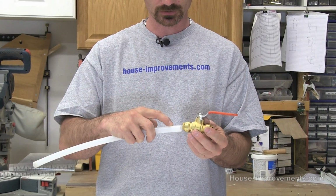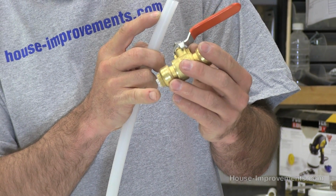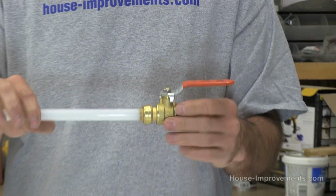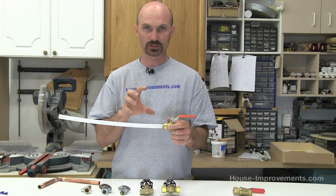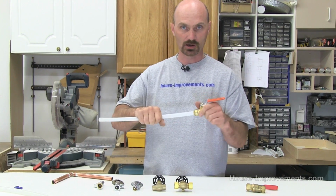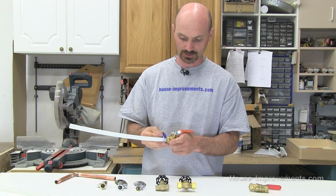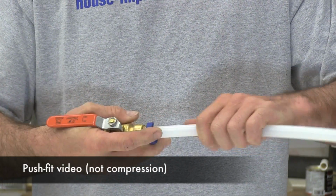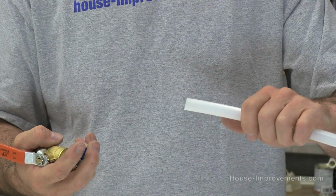So you usually put a little mark there. You can see there's a little fitting inside of there. When you're using the plastic pipe, that fitting has to stay in. So you get that in there and seat it fully. There's an O-ring in there, and then there's some stainless steel teeth, so once you slide that in there, you can't slide it back out, not physically by pulling it by hand. You have to use these little keys to release that. Again, I'll talk more about that on the compression fitting video. This little tool would just go against a rib there, and that comes out.